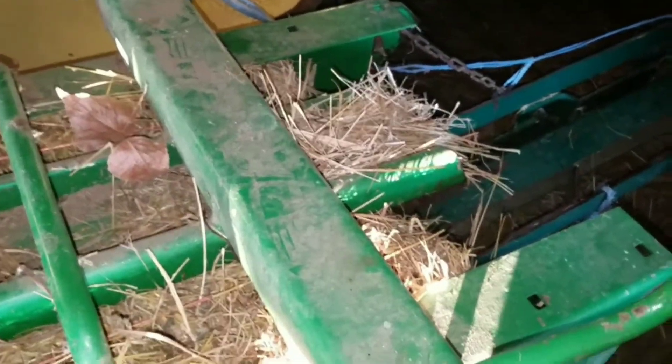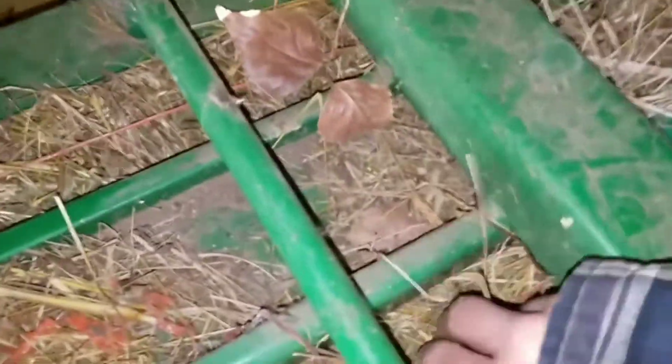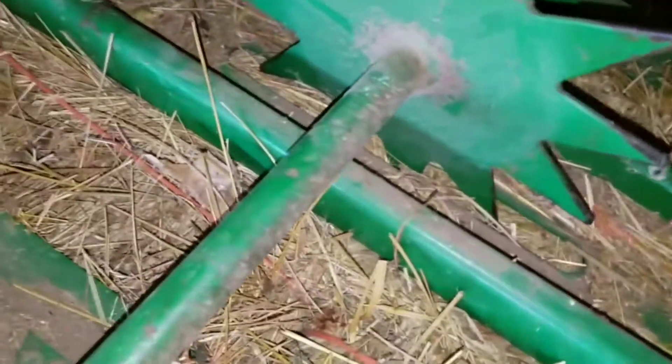About 14 cranks to start out with every year — 12 or 14. That puts tension on this so your bales are tighter and the strings aren't loose. And you adjust that as needed.